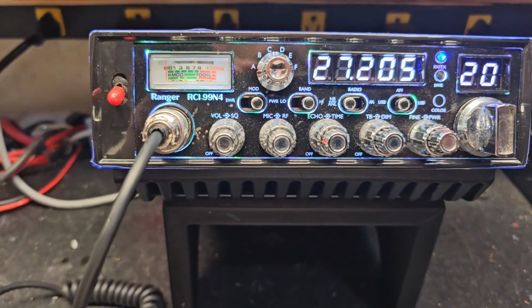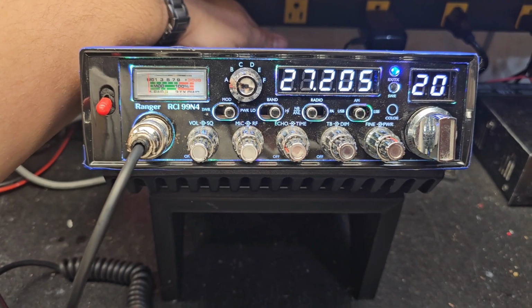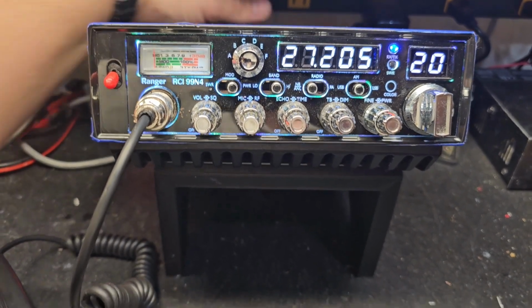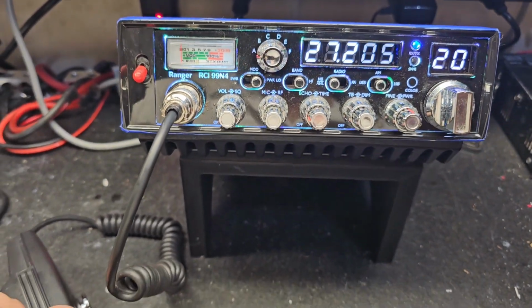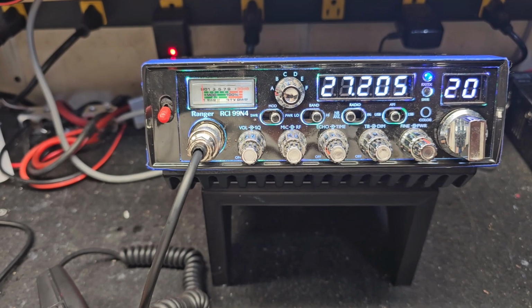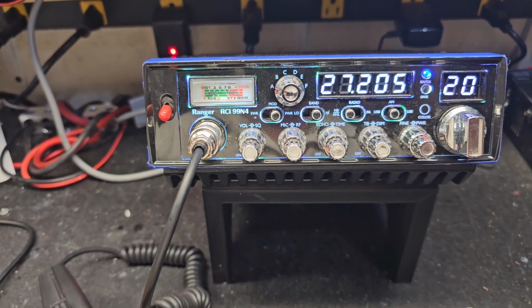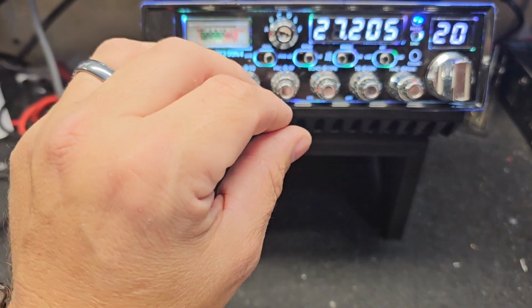All right, Patrick, we're back. We got you all fixed up, ready to go. We've got you a 10 kilohertz switch back here. High cut filter back there in the back as well. This full Truckerized package also includes the MOSFET upgrades, Toshiba voltage regulator upgrade, cap upgrades, wideband transmitter set, and so on. So let's just get right to it.